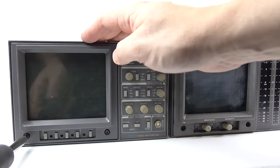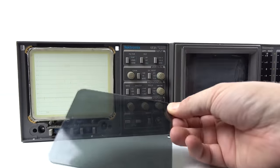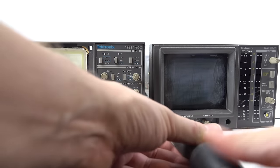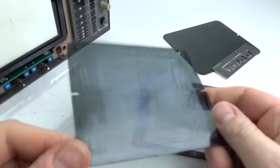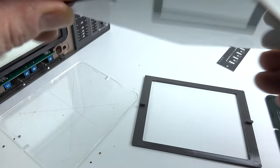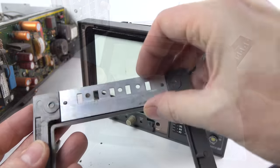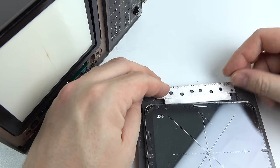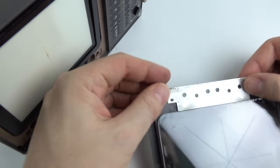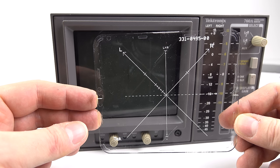Tektronix made a lot of interchangeable components on their oscilloscopes, so most of these things were available as spares listed in the back of the manual. Once you take the front off, I can get the tinted plastic out of there, take the same two screws out of the other unit - which is only too happy to fall apart - and swap out the nasty scratched-up piece of plastic with the nice clear one. Obviously give that a nice polish as well. It goes in the same surround; unfortunately you can also take out the base of that surround, the metal plate which surrounds the five buttons on the first oscilloscope, and swap it with the one surrounding the two knobs on the 760A. The whole thing just assembles again with those two screws. I didn't bother using the scale because I don't need it - it obscures the image and also didn't fit particularly easily.